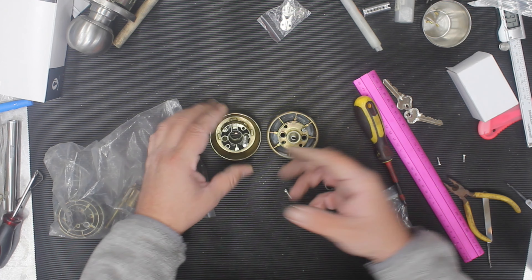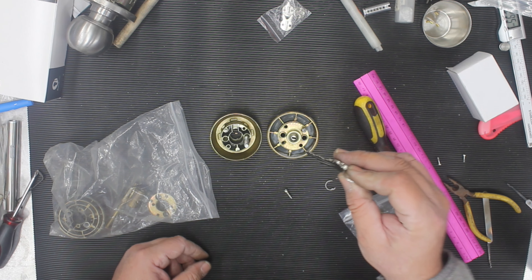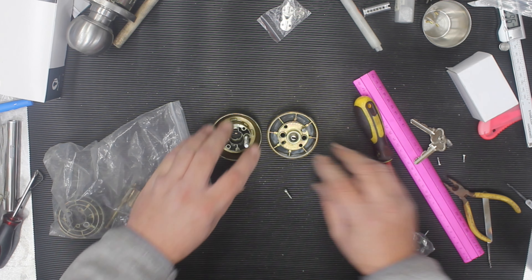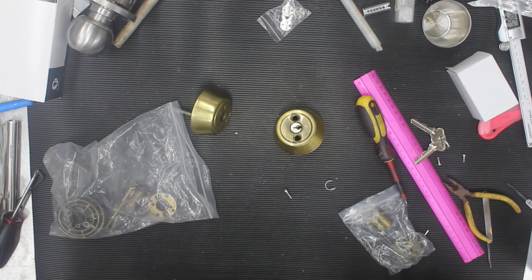Put it back on the door and you're good to go. The only difference between the outside and inside is the inside has the long threaded bolts which clamp the lock together. Once it's all back on the door, test it from both sides with the door open — turn your key, does it lock? Turn your key, does it unlock? Test from both sides and that's it. That's the Gainsborough hub we sell on our lock shop at ourlock.com.au. Leave your comments down below, thanks for watching.